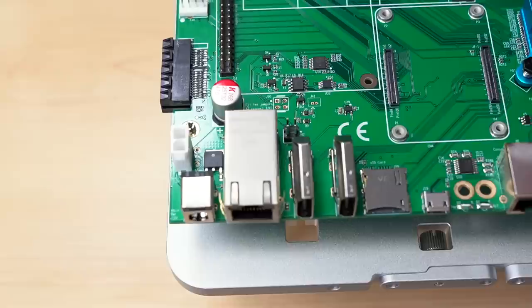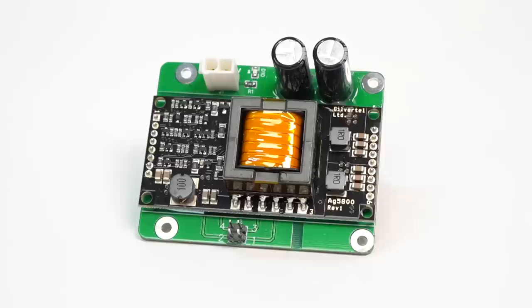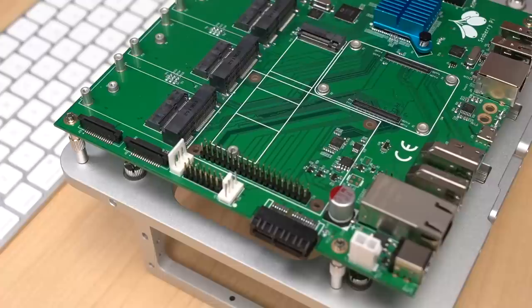When it comes to power, this board has even more tricks up its sleeve. In addition to the barrel plug, which can handle up to 9 amps, you could simultaneously power the board with this 12-volt aux power jack. The Seaberry will automatically switch over to it if the primary supply fails. And there's also a PoE header — you could add high-power PoE++ through a special adapter and power the board with triple-redundant power supplies.